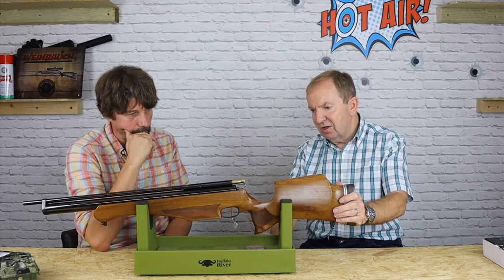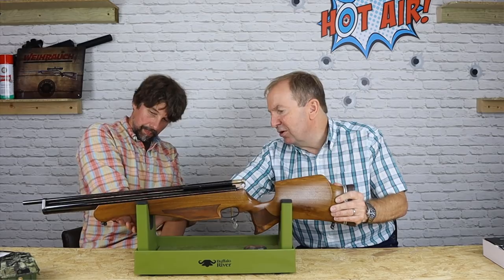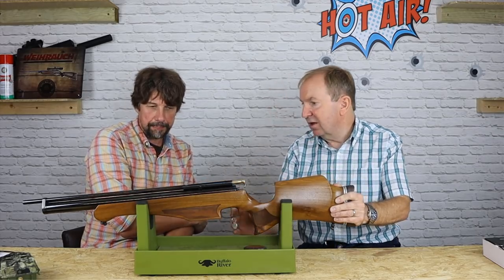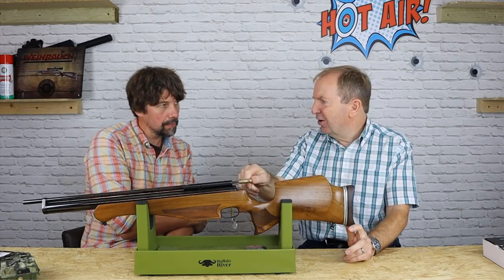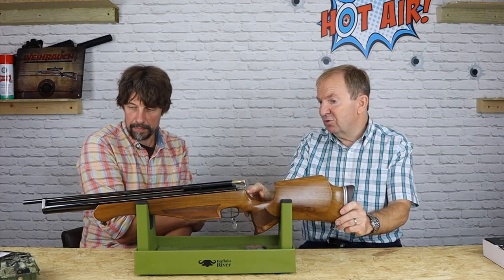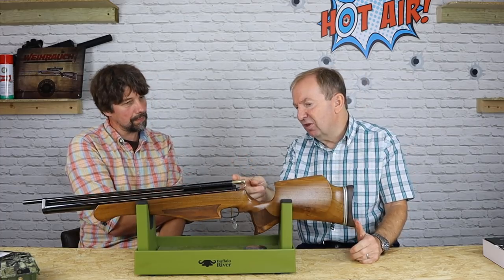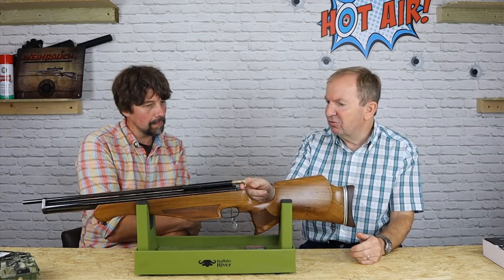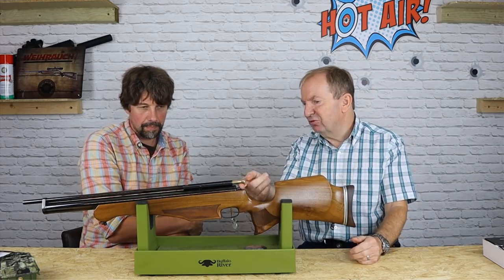Stock by Custom Stock — a 1985 custom stock. This is an early one, what I call the Queen Anne chair front — it's got this deep snorkel tip on the front. The later ones made that a little bit shorter. This swan neck's interesting — a little detail on that. They were hand filed. They couldn't afford the tooling to cast for years, so every time somebody ordered a swan neck, somebody went down the workshop with a file and a piece of bar and filed it out. You can spot the hand-filed ones. That one came out of a box, the prototype one they used to copy. So that's the swan neck bolt, and they're all slightly different because they're all filed.